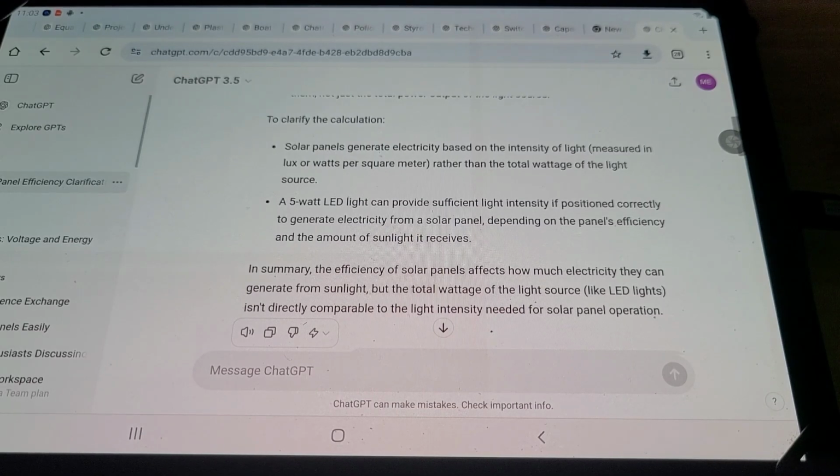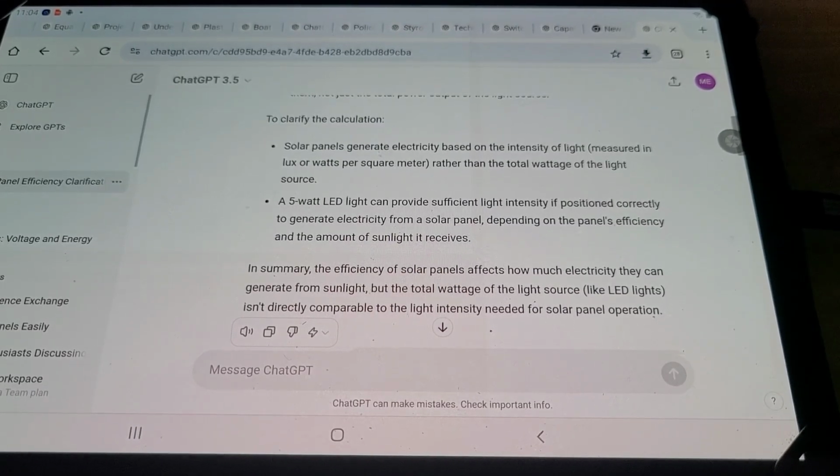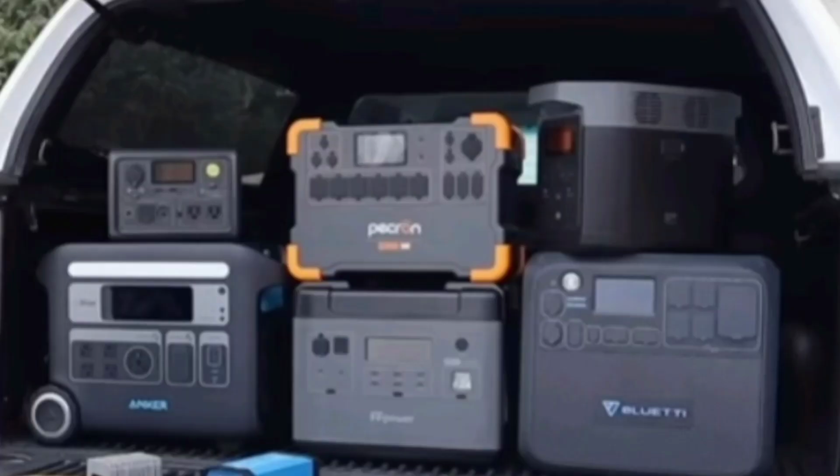Second of all, the blinking lights were caused by diodes or circuits that prevent pass-through charging. This may come from complaints from people who said it damages the batteries. Even so, what we noticed is that anything high end still has pass-through technology. So if you buy an EcoFlow, guess what? You can plug it in to the wall socket and still use the energy. Jackery or any other high-end power supplies do that, functioning like your cell phone.